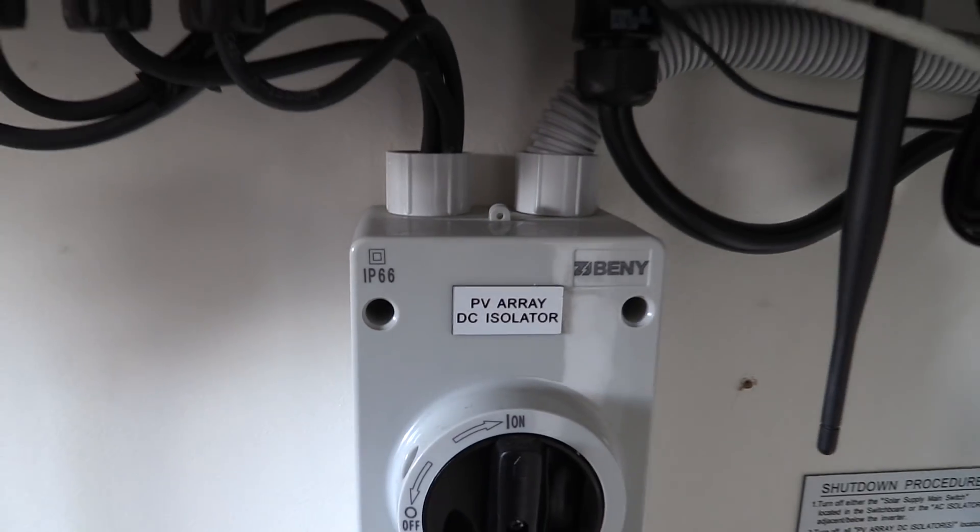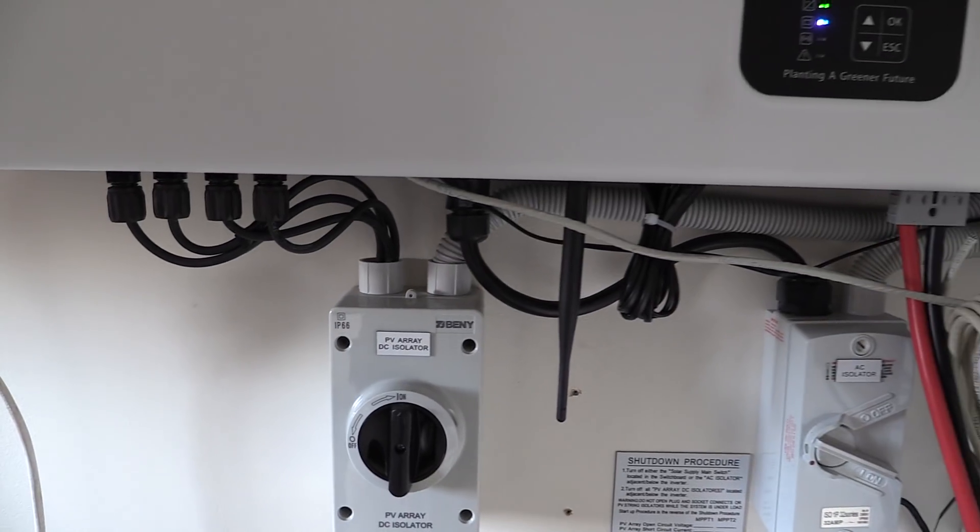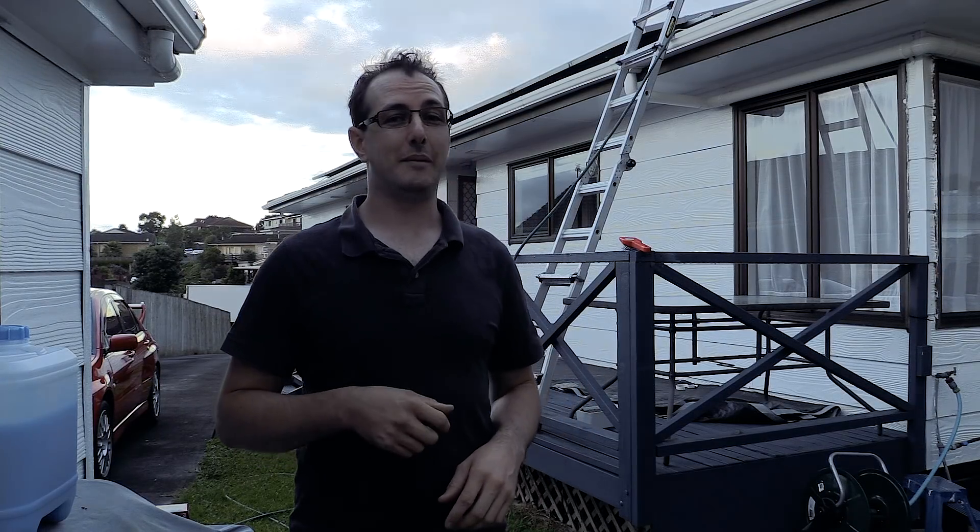We want to make sure that we turn off our solar disconnect to our roof to make sure that our roof is disconnected from our inverter, because we're going to be spraying water all over those panels. This panel sits at around 300 volts for each of those strings on the roof and the last thing I want to do is get a shock. To help mitigate that, turn off the solar disconnect — it'll be either on the roof or beside the inverter like mine. Turn that off and then get up on the roof and clean those panels.